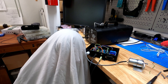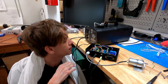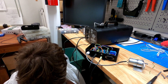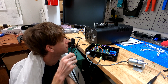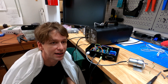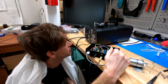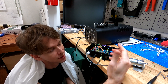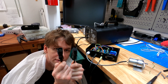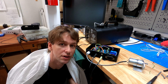And now for something truly scary: a lesson in electrical safety. The back of this fog machine has a female IEC mains connector on it for the remote control interface. That's good, because if you take your typical power cable from your computer, you can't plug it in here, so you can't accidentally introduce mains power to the remote control interface. I probably should have put a female connector on my relay wiring and used a male-to-male cable to connect the two. But all I had was male connectors — they're much more common — and female-to-male cables like this one. What I really should have done is put a female connector here and gotten a male-to-male cable. So don't do it like I just did it.